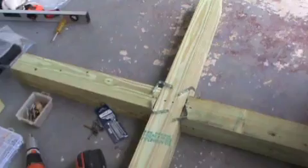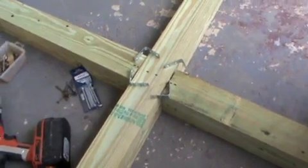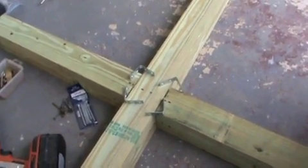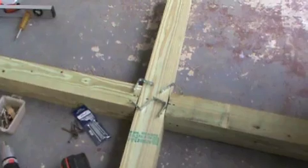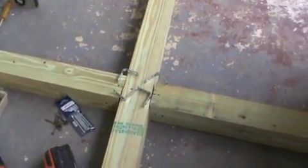What I'm doing now is putting together the base for my solar panel kit. This base is going to sit on the ground and extend upwards, and it's going to be a tracking unit for the actual solar panels. I'm going to take the two by four pieces of wood that I have right here and put them right where you see those markings. On the top of it, there's going to be a Lazy Susan, and once the panels are affixed to that, it's going to easily help me track the sun.